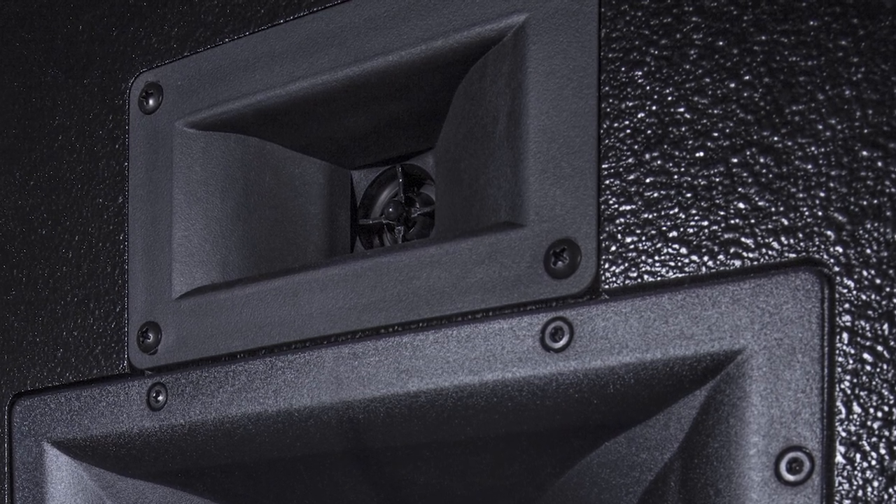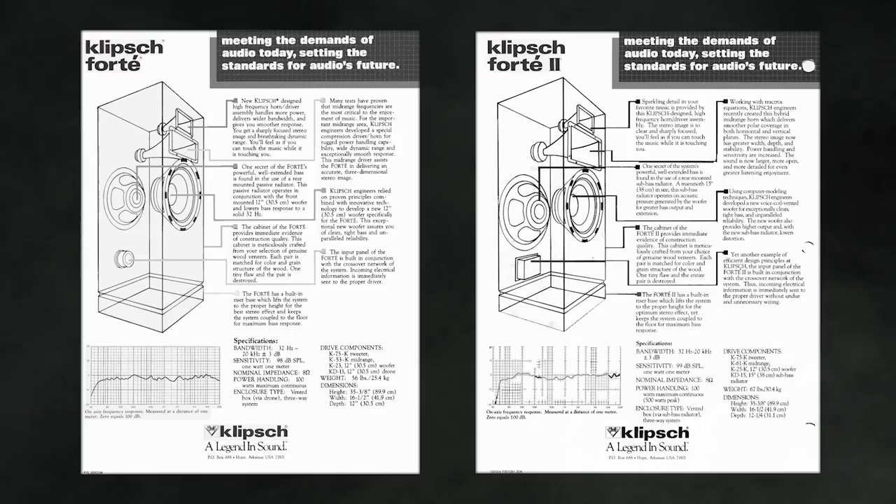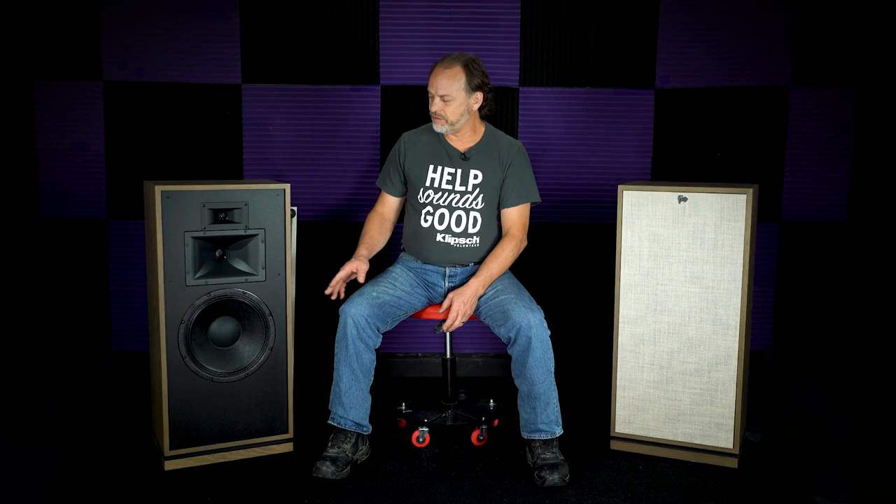And then of course there's the new tweeter they're using — very similar to the original, very similar to the Pro cabinets, which is where this thing originally came from. The drivers used in it were built and formed after the drivers used in the Pro world. In this case, titanium, but in that time it was the phenolic diaphragm assemblies used in the Pro world. The horns were very similar. If you look back at the old Pro products from the early 80s, you'll see the same horns and drivers. What that does is refine the sound of your Pro system to be a little more capable as a home speaker, and beef up the capability of your home speaker to be a little more horsepower-driven, similar to what you get from the Pro — best of both worlds. Good engineering.